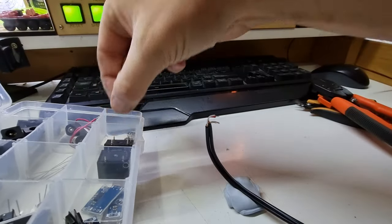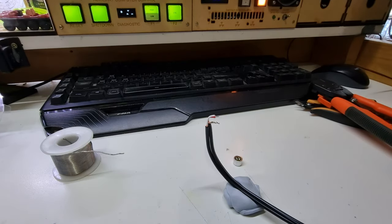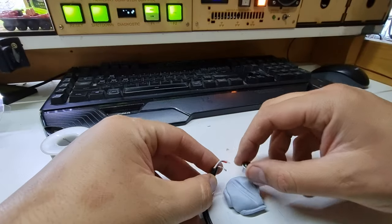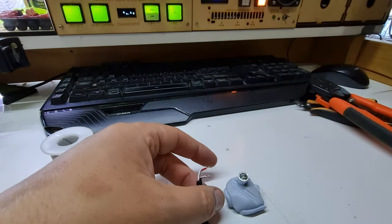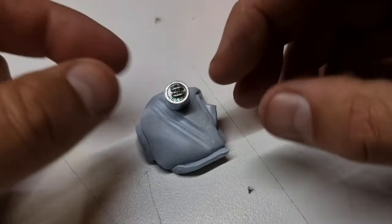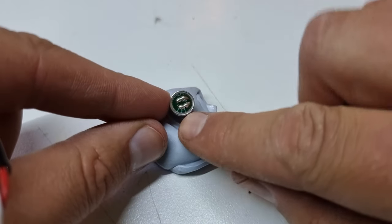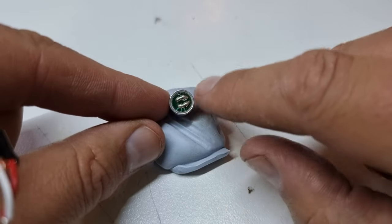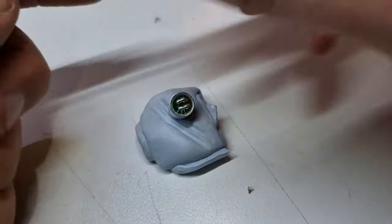There should be one in here, and I have washed the residue of the hand sanitizer off my hands, so I'm not covered in oils. Now, when you're looking at these condenser inserts, I'm going to need a different zoom level here to show you. All right, we're at a slightly higher zoom level here. You will notice on these condenser inserts that on this side there are these little bits of circuit track running to the outside of the can. That's the negative terminal, or the ground.